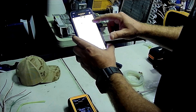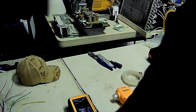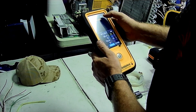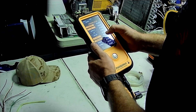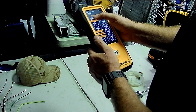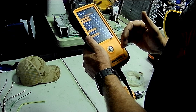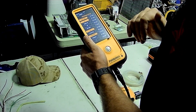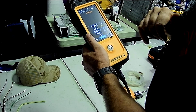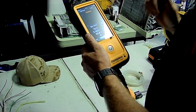Here you set your fuel type — atmospheric burner — and you can change that. I like the big screen and that it's touch. You can set your limits: excess air, CO2, flue draft. For what I want displayed, I'm looking for flue draft, CO in parts per million, O2, and stack temperature. So I've got CO PPM, stack temp, draft, inches of water column, and O2 — everything seems pretty good on here.